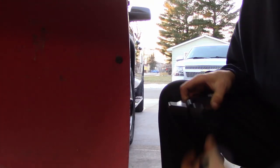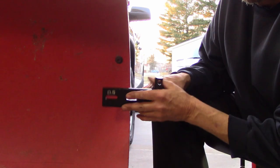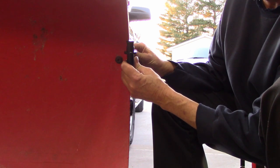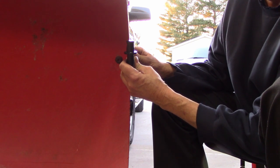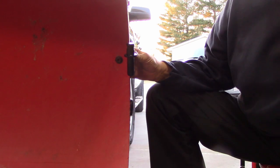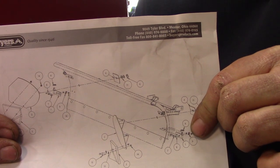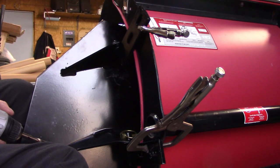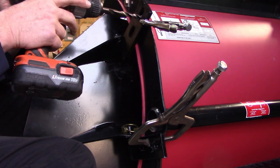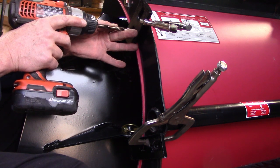I'm going to do a little bit of thinking and look at the instructions because yes I am following the instructions. The first obstacle is these are supposed to bolt onto here, but this being plastic I'm not going to do that — I'm going to pull them onto here. That's going to take a little bit of clamping and I'm going to have to cut some edge out of here, which is no big deal, it's just plastic. I'll take the flat grinder and just grind that off. According to directions, it's supposed to bolt right on the face. So I'm going to put some clamps on there and see what I can do to get them where they should be. I'm putting a mark in there for the three-eighths, I'll drill a pilot hole and then come back and chase it.